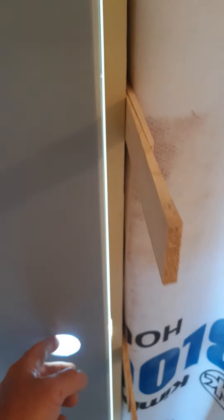I'll put a screw in that at a later time. On the handle side you're looking for the reveal all the way down. After the hinges are set and the hinge side is screwed to the board and not sprung, you're looking at the top reveal. This one was low.